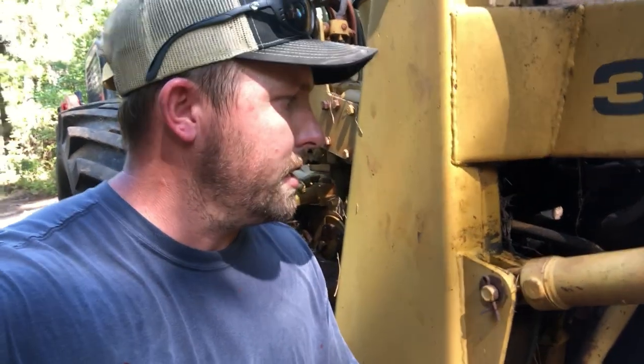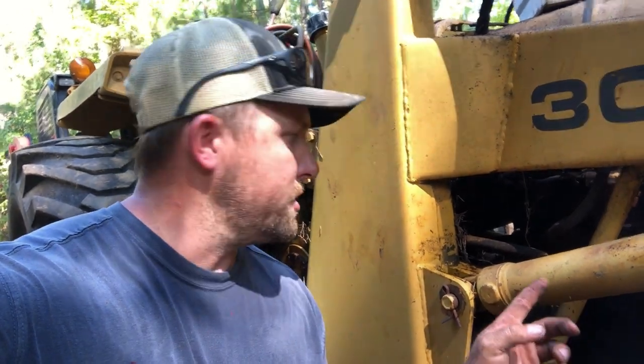All right, so now that we know it'll crank over and it's not locked up, the biggest problem, we checked the oil, it's got oil, the oil looks fine. The fluid levels are good in it, but the fuel tank, like I showed you earlier, it's got all kinds of junk in it. So what we're gonna do is get a fuel tank from a John boat, just one of the plastic fuel tanks, fill it up with some diesel, and then hook the line up directly to the fuel line where it came out of the tank.